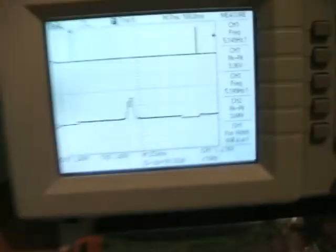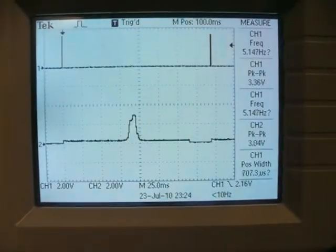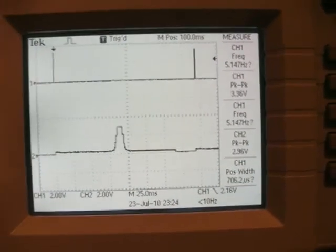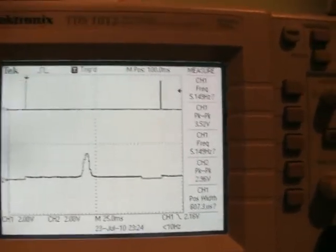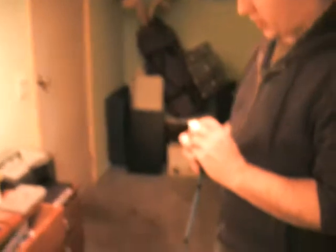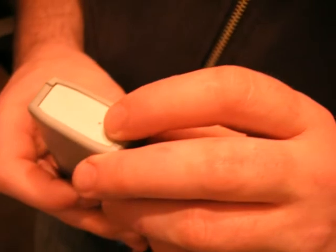Are you saying it's actually hitting saturation? Yes, it's hitting saturation — that's 2.9 to 3.04 volts at half a meter. So it's hitting saturation at half a meter, which means we could increase the frequency there to bring saturation down and make it more accurate.